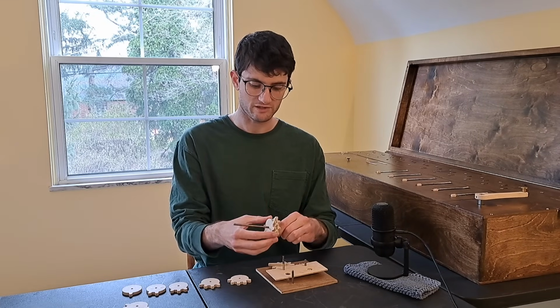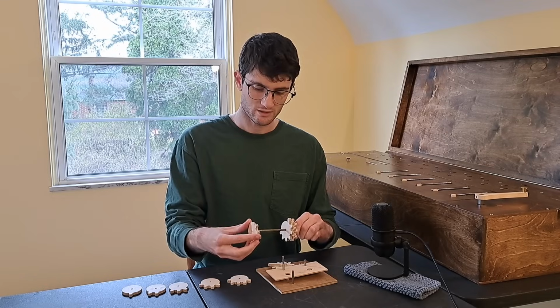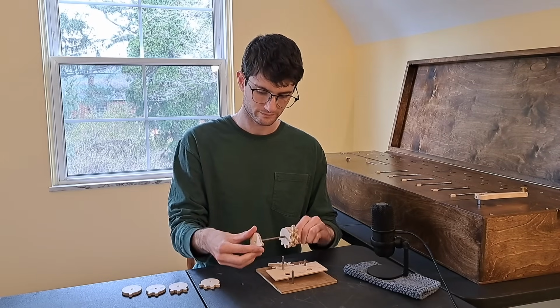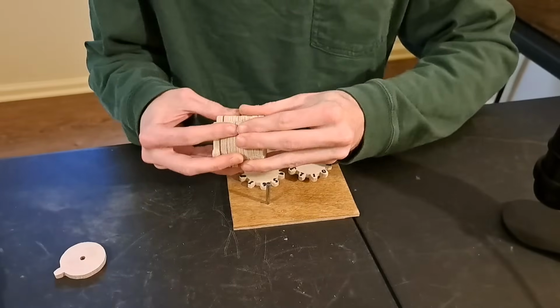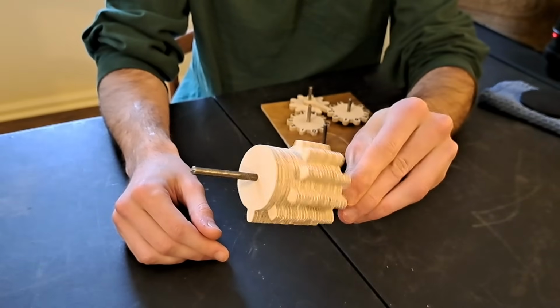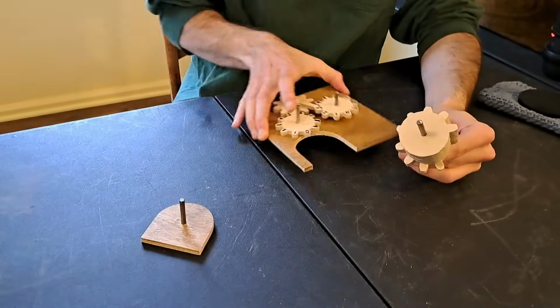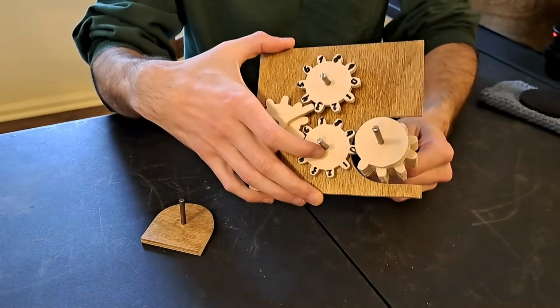And it's really just a stack of these gears, one on top of each other, numbering in teeth 9, 8, 7, all the way down to 1. It's called a stepped drum, and if you can imagine, it makes changing out the gears a matter of just shifting this drum up or down.